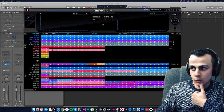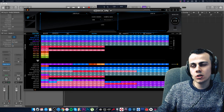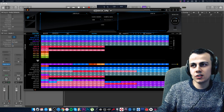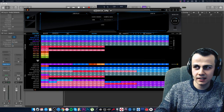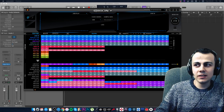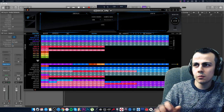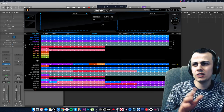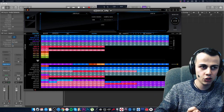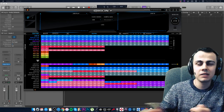On MADI quality vs USB: I didn't say MADI sounds worse — MADI simply gives more possibilities. Via MADI you can connect 64 channels, sync a Yamaha CL5 with all its RIO units, and record separate reverb buses, delays, hall sounds, etc. I'm a big fan of MADI because it just works reliably. At a concert, connect it, press REC, go work the console — you don't need to monitor it. It records perfectly without errors. For 2-3 hour concerts, I always trust MADI.